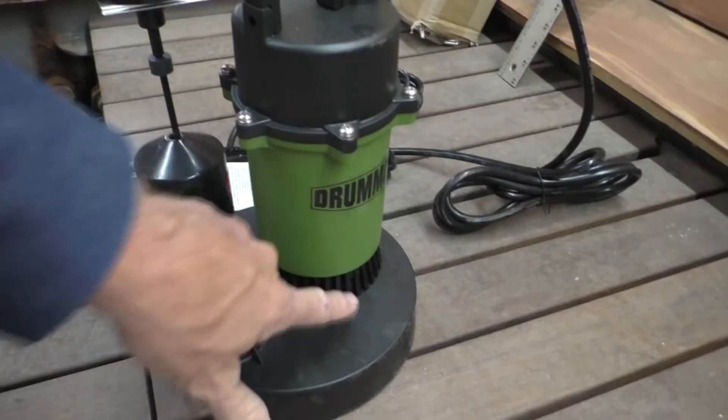The downside is they are 110-volt. Bilge pumps don't keep your boat from sinking — if you're thinking that a bilge pump's working and you've got a leak, bilge pumps can clean up the water once you stop the leak. But generally you're not going to find this size pump, or especially one of those little DC things, saving your boat. To save a boat you need a really big pump, because generally when boats are going down you've got a lot of water coming in. You've got to take care of that issue first, then worry about the pumps.